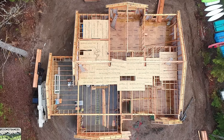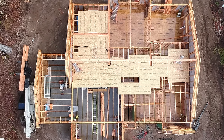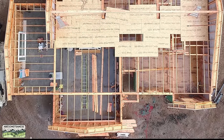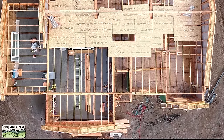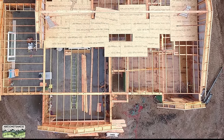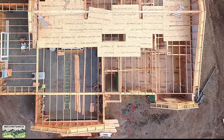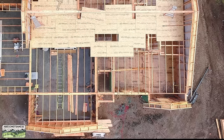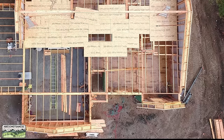Okay, so this takes us about a day to get ceiling joists and beams in. And basically, I consider that prep to actually start cutting rafters and framing the roof. What I like about this plan is, notice here along the bottom, we have our single bay garage on the left. We have a 5.5 by 15 that runs from left to right across the porch, and it's strapped to all of the walls. So that literally connects that single bay garage shear walls to the front bedroom shear walls. And then we have a single LVL that goes from that wall all the way to the rake wall at the bottom, again, all connected. So we have a nice continuous load path across the bottom of that house.